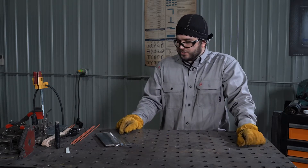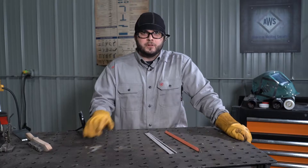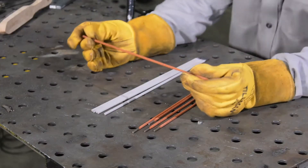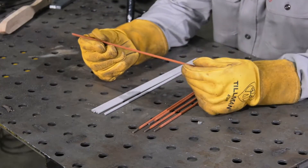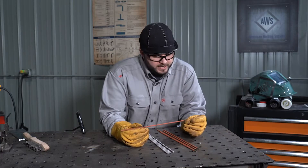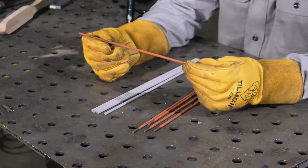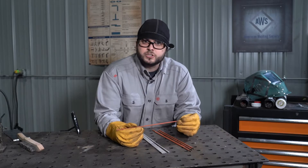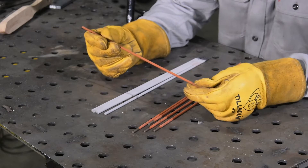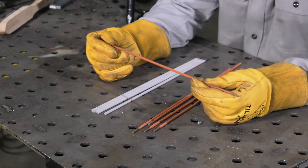Here we're going to start with a lap joint using an E6010 electrode. Fillet welds with E6010 — great electrode. Remember, this is a fast freeze type electrode. It's going to penetrate deep into the material. When we're welding fillet welds we need to make sure that we're maintaining a good tight arc because it's going to be aggressive in nature. It's going to penetrate really well, which is good, making sure that the joint root is being tied in well. That's one of the key things of this E6010. So this is a good electrode for fillet welds in a variety of positions.